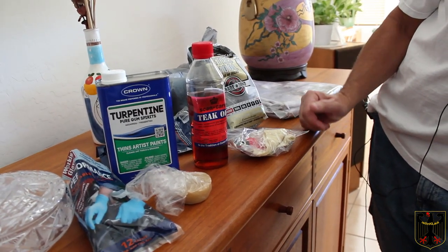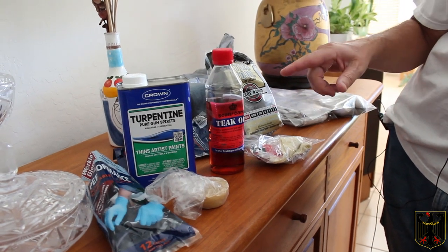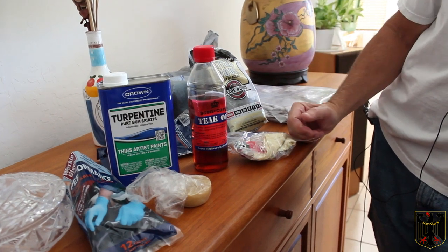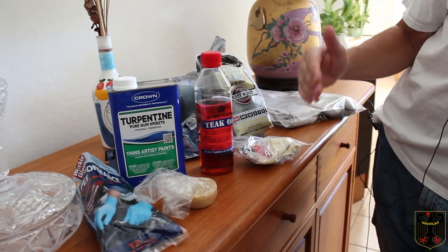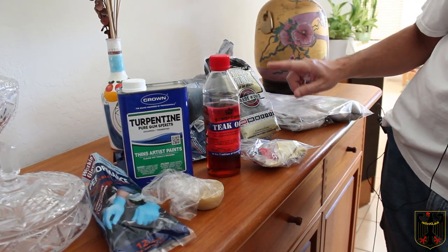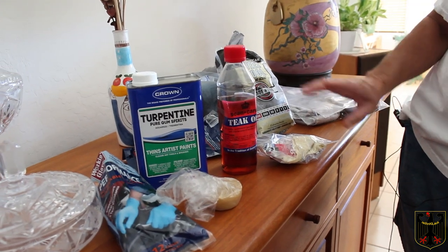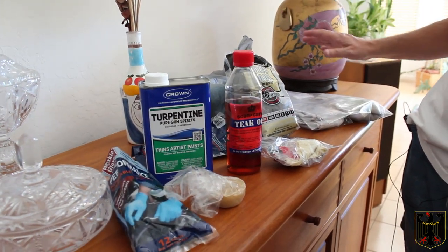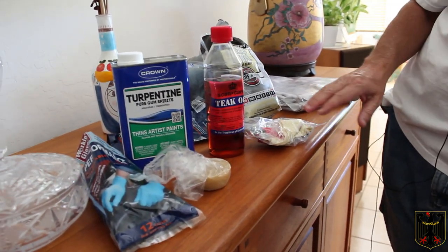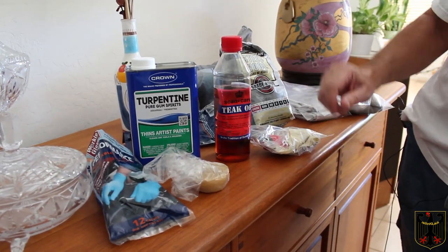The first thing I'm going to do is ventilate the area very, very well, because turpentine is not only flammable but it's very odoriferous — it smells awful. So I want to ventilate the area real well, and then I will start by putting turpentine on quadruple-ought steel wool and cleaning everything. But before I get that started, I'm going to take all the objects off of here and wipe it down with a slightly dampened cloth to get any dirt or dust off.